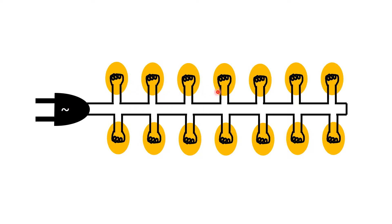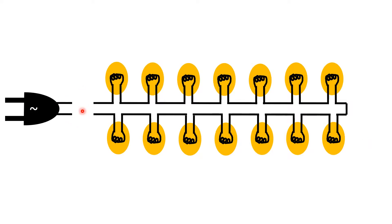All this contains are these filaments. Once you connect it directly to 110 volts it lights up, but it's just one color — and one color is no fun, so we're going to use LEDs instead. The first thing we'll do is snip this particular line and remove the connector. One important warning: you are working with AC, so be very, very careful — this is a live circuit. Do not work while something is connected, as it is dangerous. Take all precautions, disconnect everything, snip the wire — that is your first step. Then we are going to remove this particular light and replace it with a special kind of LED.